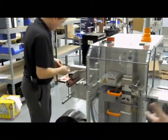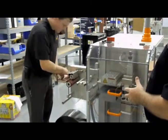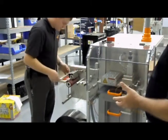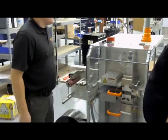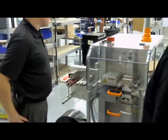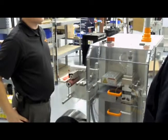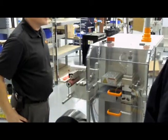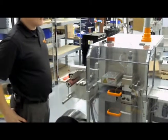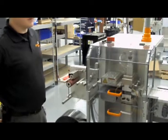I know it's going to vary from material to material and machine to machine in terms of roll size and how much feed you get, but how often do you think you might be using a splice in a typical process? Full out production time, probably somewhere in the range of once every hour to once every two hours. That's fairly common. So again, if you have a bad tape, if you have problems, that's a problem an hour — you have 15 minutes of downtime every hour if you have bad splices.